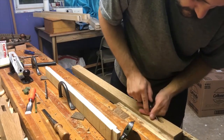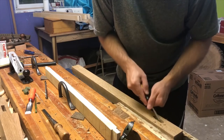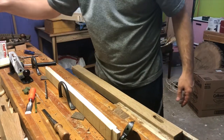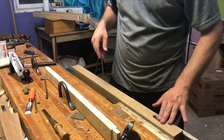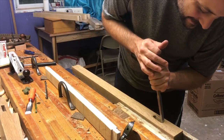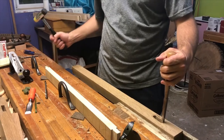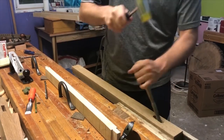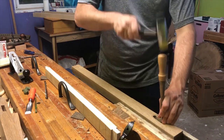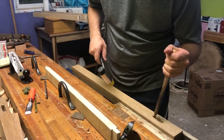And I'm of the mindset chisels and planes and all that kind of stuff don't need to be anywhere near as sharp as what you're led to believe. You just need to take thinner shavings. And maybe some of that is people. I mean, very few people have probably more than two planes, let alone a stable of planes. Because I have a dedicated scrub. Call it a jack plane. Oh, it'd be a four plane. Not a jack plane, a four plane.